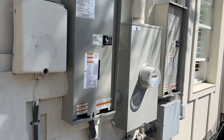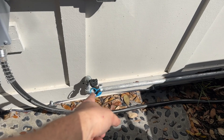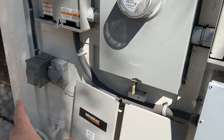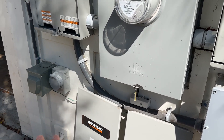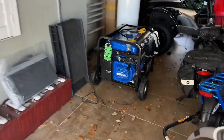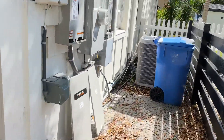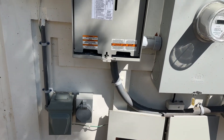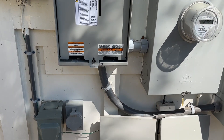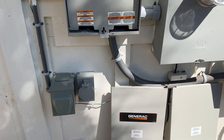My plan: I've got 250 gallons of propane in the ground with propane taps added on the outside of the house and an inlet box to run a portable generator. I can run the EcoFlows — which is the primary way, silent clean power all night long — into the inlet box. My idea is to deplete the EcoFlow Ultras down to about 10%, throw on the Generac, have each Ultra plugged into the outlets. The Generac produces 24kW; I'll only be pulling 14 to 15kW with everything off. It'll charge those up in about two hours, then drop the Generac back down so I'm not sucking all the propane out of the ground. That's my plan.